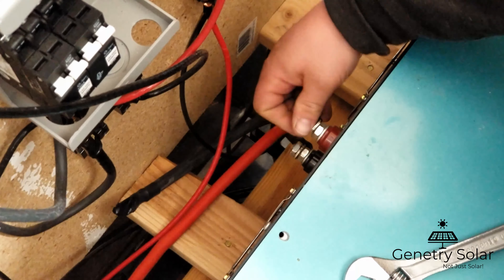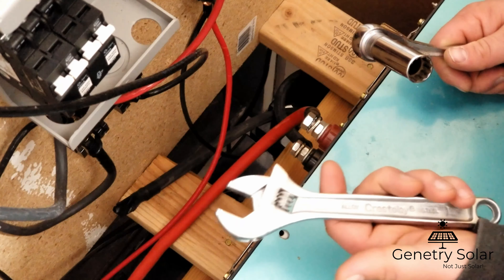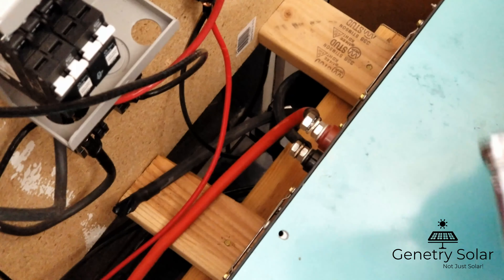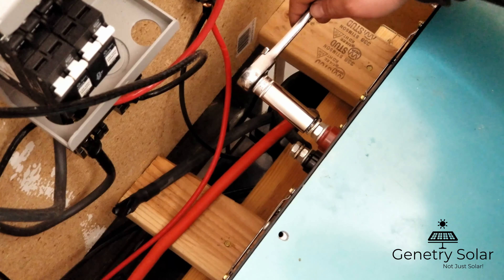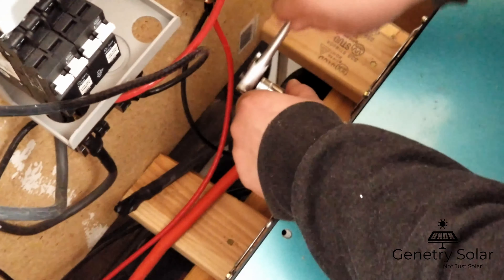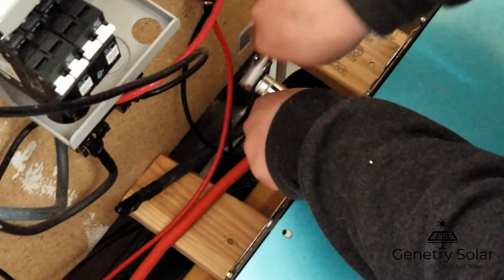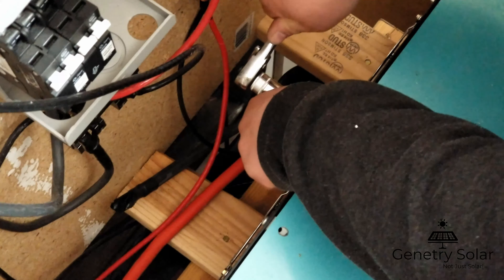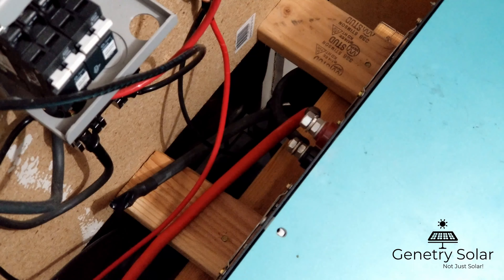Sometimes I use a crescent wrench because it allows more movement with the inverter based on my situation, but I also have my 17mm that I use. What's also important is you can see how close I am to metal on either side, and even the negative terminal on the bottom — if you keep going it's always possible to accidentally touch the case or ground of some kind, and then obviously you'd get a big spark, which is not very good for your batteries. So be real careful when hooking these things up. There's a lot of energy flowing through here — I'll torque these down a little bit later, but just verify that everything's working.